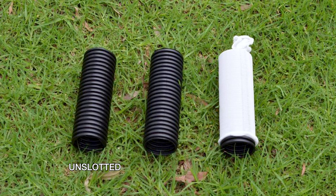Unslotted is generally used to shift water from A to B. Slotted unsocked pipe is used for free-flowing soil or gravel that surrounds the pipe. Slotted socked pipe is used in areas where slots could be easily blocked from certain soils — this one is recommended for most applications.